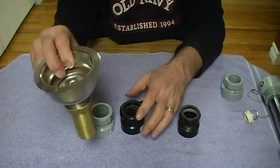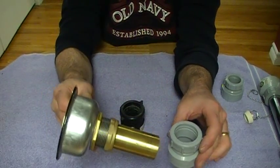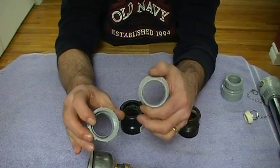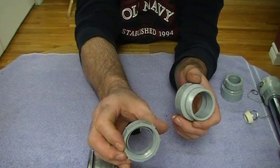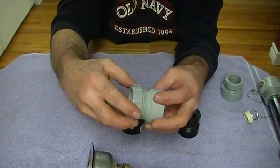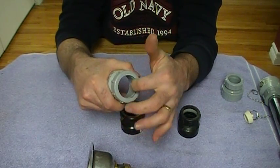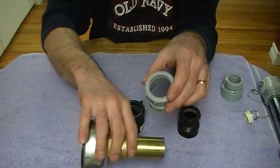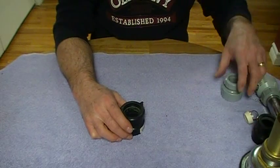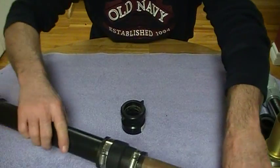This is a kitchen sink strainer, and this is an inch-and-a-half trap adapter that is also only two pieces. It also has a tapered nut on the inside, and when it's threaded together the male part pushes it out and tightens around your tailpiece.